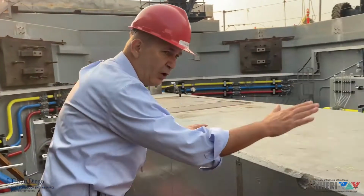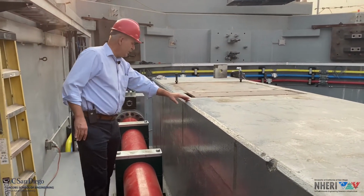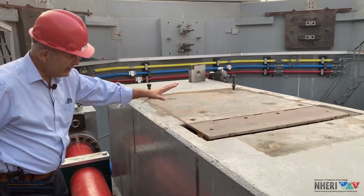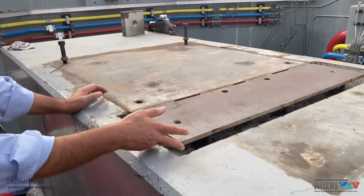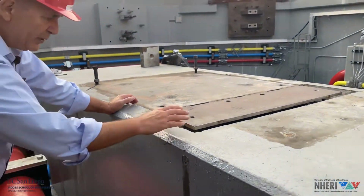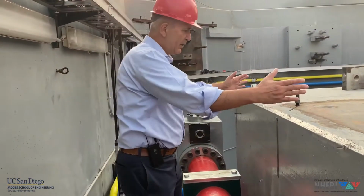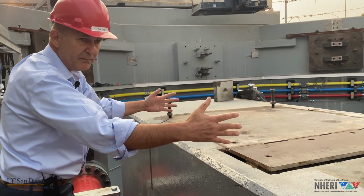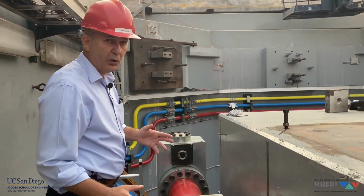So now you can see the large wall here that is supporting 3 of the vertical actuators. You can also see the steel base plate that will support the vertical actuators. As I explained earlier, 4 of them had to be extended. You can see the extension here with rebars welded to the plate and anchored down to the concrete. We still need to grout this. We had to do this because the vertical actuators in their new position will be 10 inches more on the inside than before to accommodate the kinematic capabilities of the platen with the new horizontal actuators.